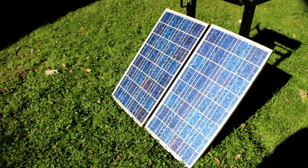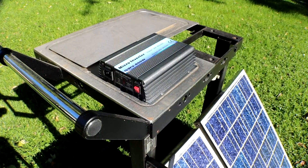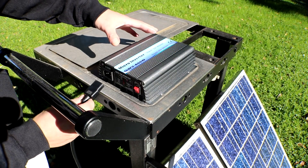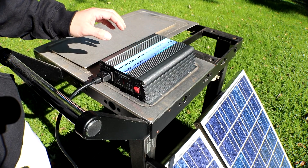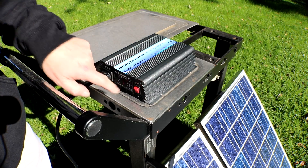Alright, we are outside so I apologize for any wind or random vehicles driving by. I have two 45 watt solar panels here and I'm going to be hooking them up to the micro grid tie inverter. I'm going to show you an example of a 12 volt hookup only where the voltage would be too low and the status indicator is going to read low voltage. Then I'm going to wire them in series and that should get us right in the optimum voltage range. The first thing the directions say is to go ahead and plug in your mains outlet.